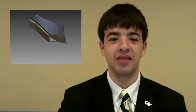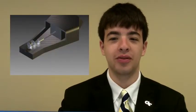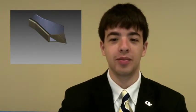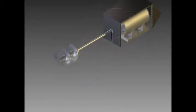The impeller unit provides thrust for the D-Hawk during waterborne operation. It is mounted on the underside of the board and works by taking water in at the front and forcing it out of the back at high speed and pressure. The front of the unit includes 2 large intake ports for water, as well as a watertight cover to protect the motor. The sides of the impeller taper in, which causes the water's pressure and speed to increase as it moves through the unit. At the far end of the housing is the impeller itself, which propels the water through a tapered nozzle and out the back of the unit.